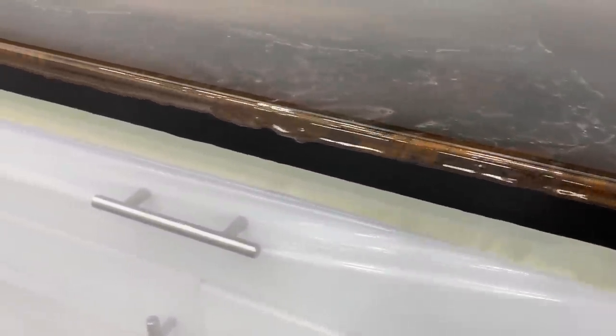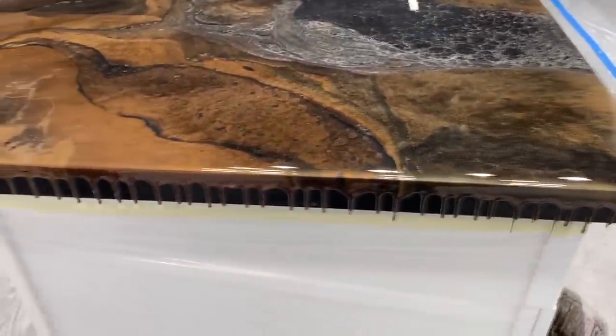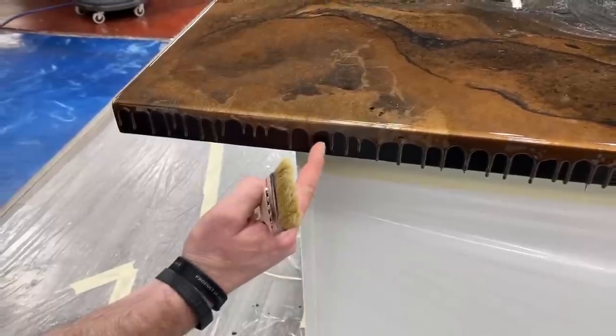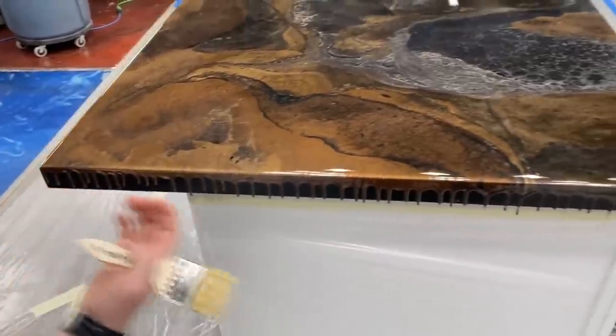Turned out absolutely beautiful. So you can hear behind us where we first pulled the drips, it's already getting to the bottom. So what we want to do is this is basically surface tension. So a lot of these drips will keep running down the same drip. So we want to brush this in and help this evenly flow over the surface.